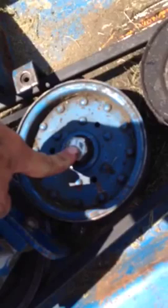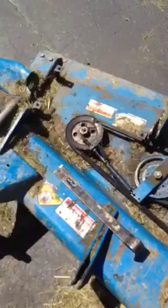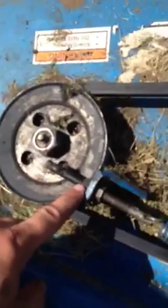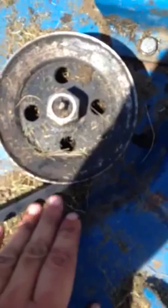You've got to tip the mower up on its side to get to that lock nut and get it off. Once you've got all that off, pull this spring off — the belt's going to be broken so this will move easily. When you're going to put it back on, it's just the opposite order: get everything lined up, put the gearbox in, bolt those things back down. Then loosen this nut all the way out to give you the spring tension to be able to attach it.